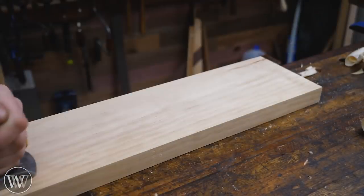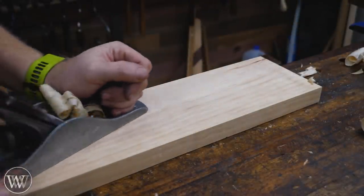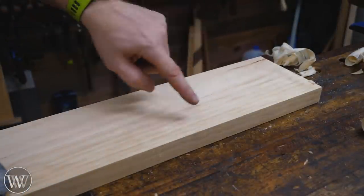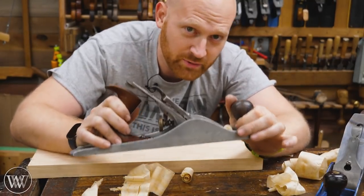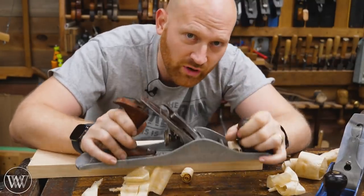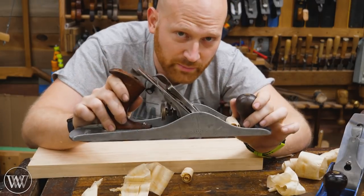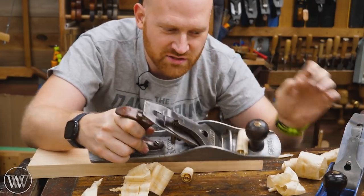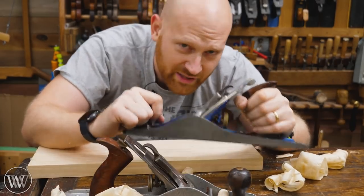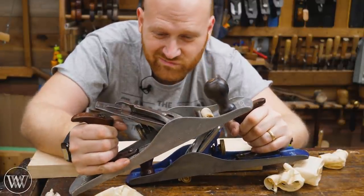Don't get me wrong, they work perfectly well. But if you have aluminum on here, you're going to start getting these dark marks on your wood. It's kind of hard to see on the camera, but in reality they show up — the aluminum is actually rubbing off onto some of the high spots on the wood. Scuff marks like that just don't speak well about a plane. And then probably the big nail in the coffin is that in the 1920s, power tools started to become more and more available, especially if this was your business. If you were a full-time woodworker, you eventually started getting a thickness planer. That meant you're using this less and less. It's not a tool you're going to be using for 16 hours a day. It's something you use to clean up, do finishing, kind of how we use it today. And in that case, you start to like having a heavier plane because it has a little more momentum. Because you're not using it all the time, it's really not that big of a problem. So the whole reason for getting an aluminum is kind of going out the window.